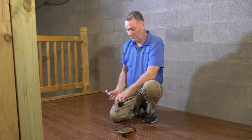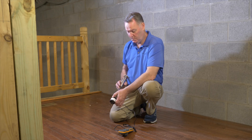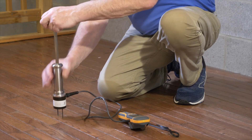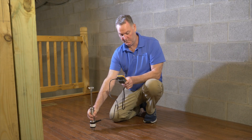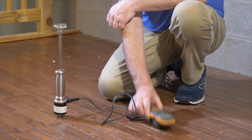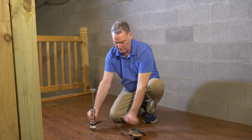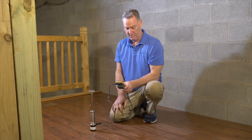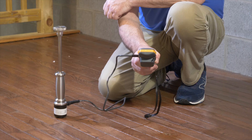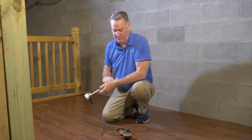Now we'll look at the wood floor area and take measurements through the depth of the floor and into the subfloor. Holding the hammer straight at a 90-degree angle, we use the heavy-duty hammer probe to take a reading just below the surface, then halfway through the floor and into the subfloor, and finally drive the electrode all the way in for a final reading — recording all readings each time. It's important to repeat this daily throughout the drying process. When removing the hammer electrode, use the slide hammer action and drive straight up to avoid breaking the pins.